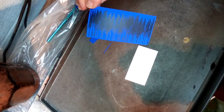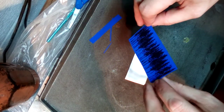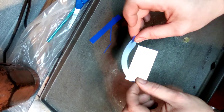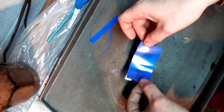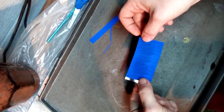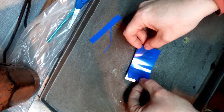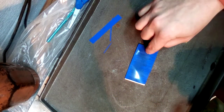This is the most difficult part of the transfer, in my opinion — actually laying down the paper. What I try to do is line up the corners. Remember, everything's really hot. I have the PNP paper bowed a little bit so it's going to touch down in the center first. I'm looking through the shiny part of the paper to see the transfer image underneath — you can see the black through the shiny — and I'm using that to line everything up. Now I'm just being as still as possible, holding my breath, and laying it down.